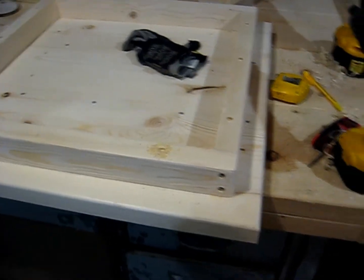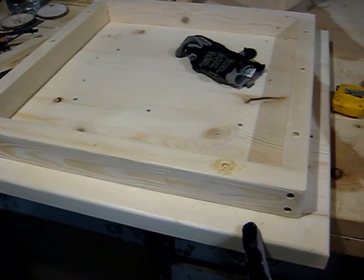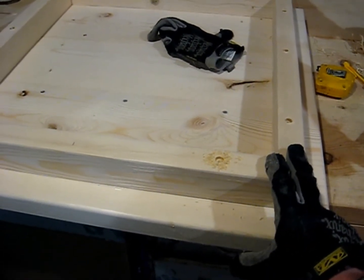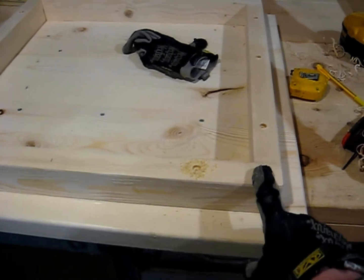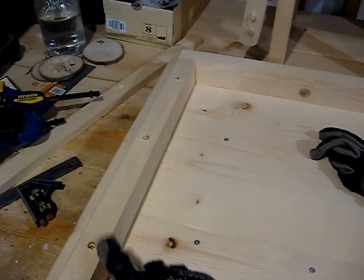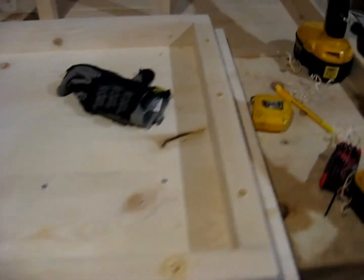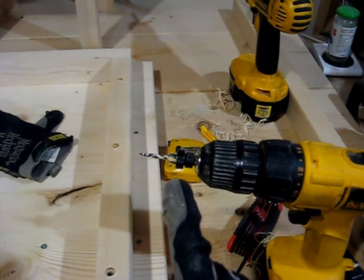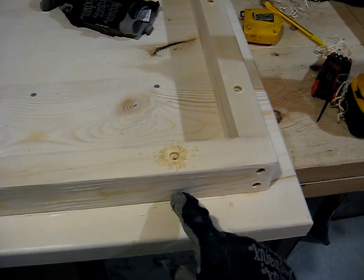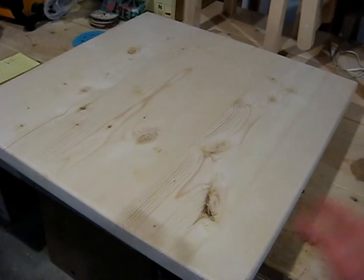Here's the table so far. I have the top pieces screwed together and went around the corners — both top and bottom — with my router. When I started working on the skirt, I decided to keep it in about an inch and a half. I ripped two-inch boards and just have them screwed in the corners. Right now I'm drilling holes and screwing them to the underside of the table, countersinking the screws using about two and a half inch screws with a quarter-inch countersink.